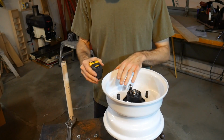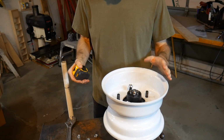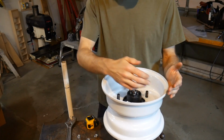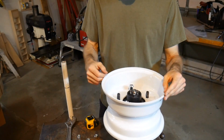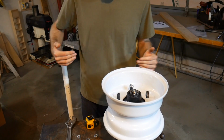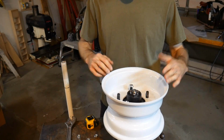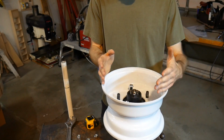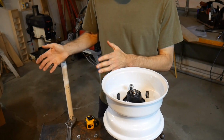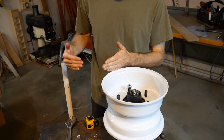And so in this case, if I use an 11-inch diameter, I can only have 11 inches of travel. And if I want to expand this table to account for this 5-foot diameter and then have a certain percentage, I have to allow for that. But when I have this increased diameter here to potentially allow more expansion, I'm also restricting my ability of those carts to slide back and forth and have that travel, right? So by expanding this ratio, you increase your expansion, which requires more travel, but you also start to take over some of that area where the cart is going to travel.